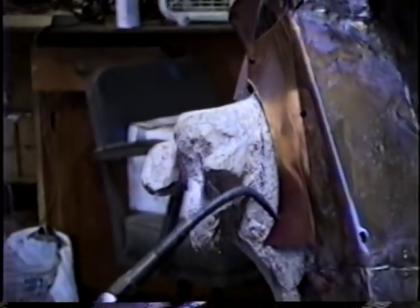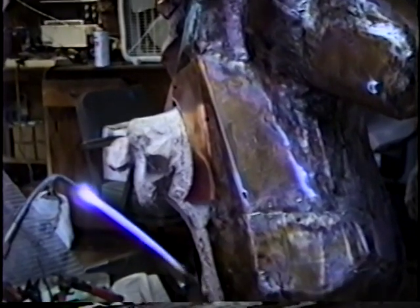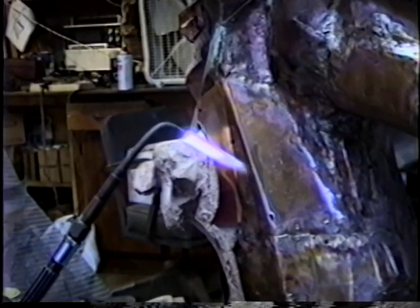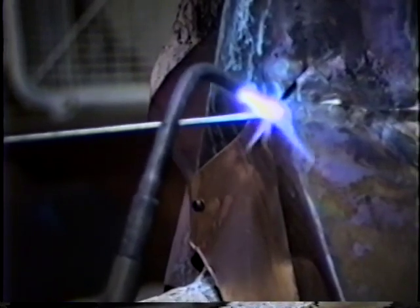Voila. When you are welding with this, it's a very, very light flame. You could almost do it with a propane torch. Haven't used it in a while. So my rule of thumb on this is that if you just barely can hear it, that it's just about the right temperature. Too much and it will melt the copper. Too little and you'll spend a long time.